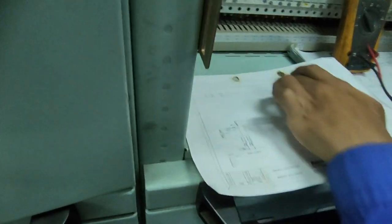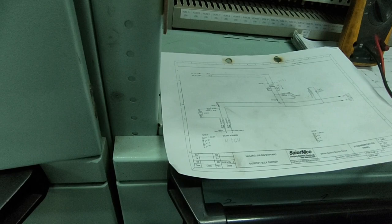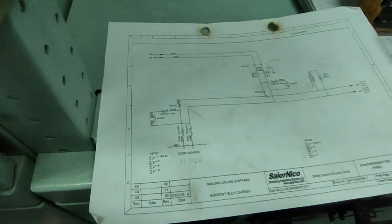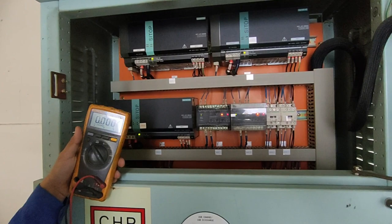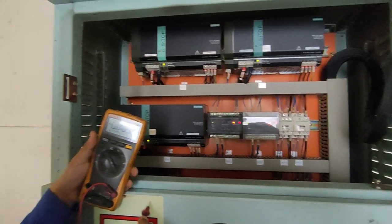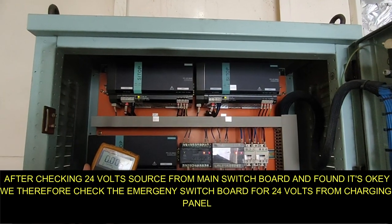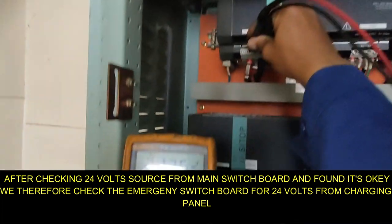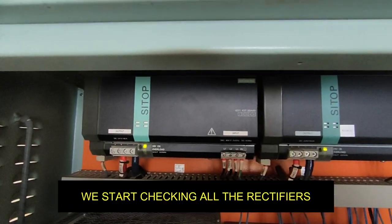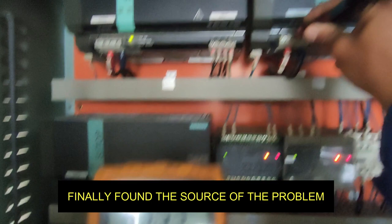From the other side we'll check again — this is 24 volts. As we have a problem, we have more than 24 volts in our system. We'll check here — this is our main DC panel for all the power in the ship. Number one rectifier reads 24 volts. Then another rectifier — number two — we have 33 volts. We have over-voltage in this rectifier.